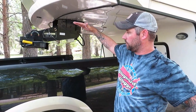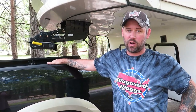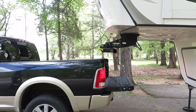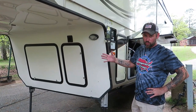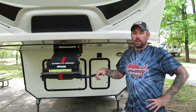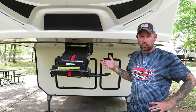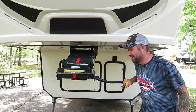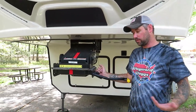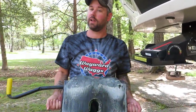Even when coming off straight, make sure you lift above the side rails of your truck — because if you're at an angle you'll be coming off at an angle, and if it's not high enough it'll hit the sides of your truck. Once you're off the hitch, level your RV as you normally would first. Now that we've driven the truck off, we'll take this hitch head, put it back on — there's no tension anymore so it's easy. Release it, pull it straight off the front just as if you were regularly unhooking.